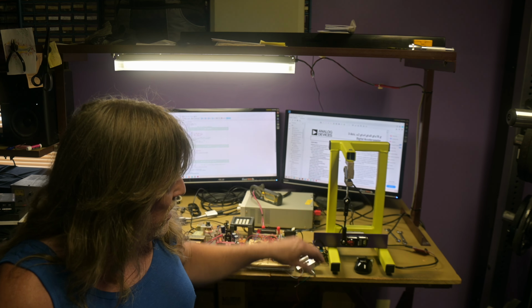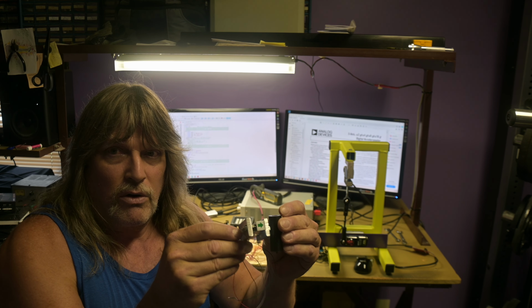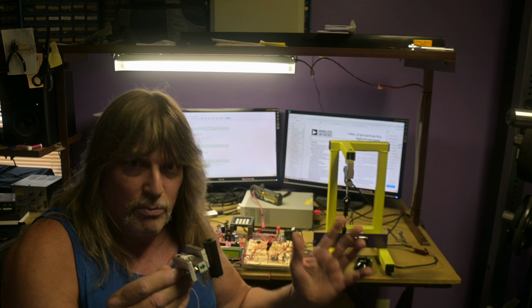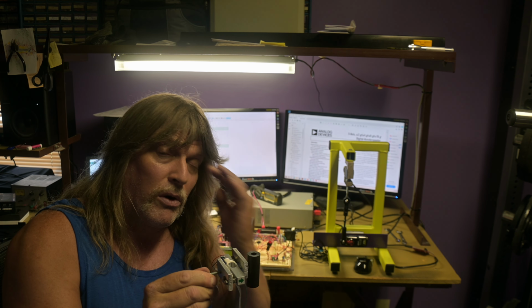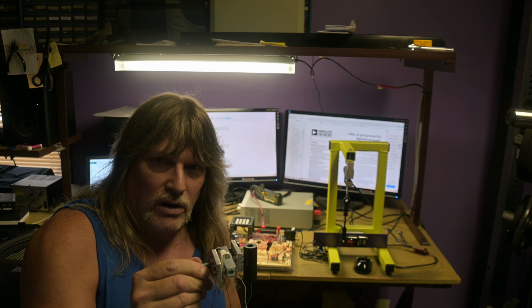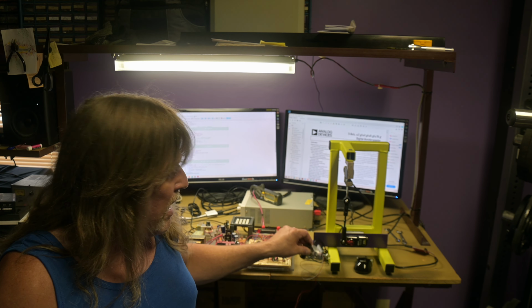And then I'm going to go back out, take that information, take this device here, which is going to attach to the bell crank on the Kraken, and then take it out and put it in the grass, provided it ain't raining, and just give it some pull push test to see what kind of numbers the steering load is going to be on this thing. Once I'm all said and done with that, I'll put everything back together and then head up to the track and see how it works.